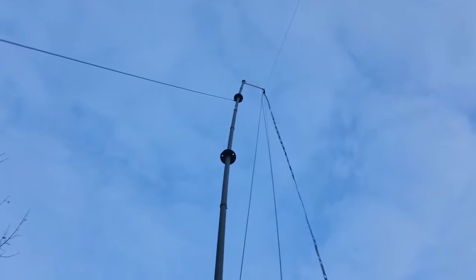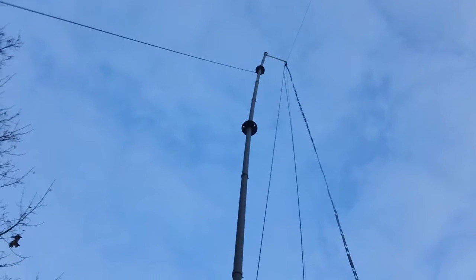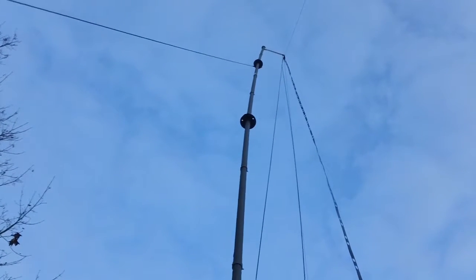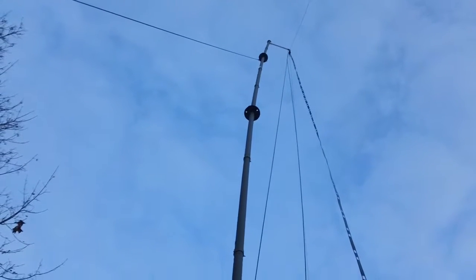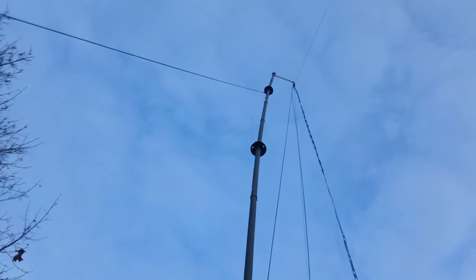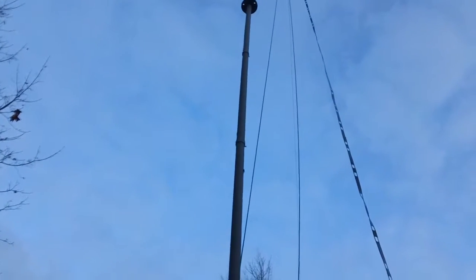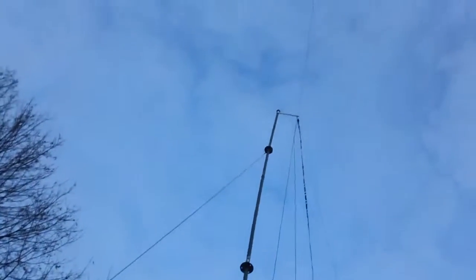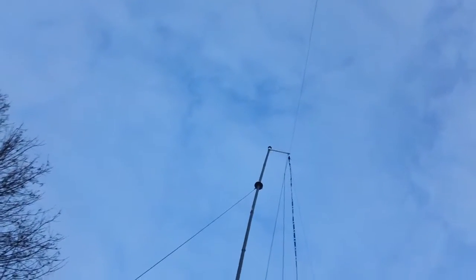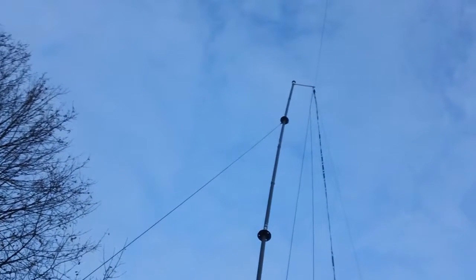The antenna was too heavy before, and I had too many segments in it, and it was always bending. Never buckled, but it always looked like it was gonna. So I took one of the segments out, and it's much more stable now. It's probably about 37 feet tall, I think. These segments are like 3.5 feet. They're not quite 4. They're aluminum, and they're all screwed together with stainless steel screws. I now only have one guide rope because that's all I need.